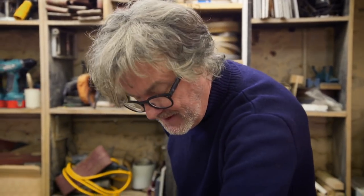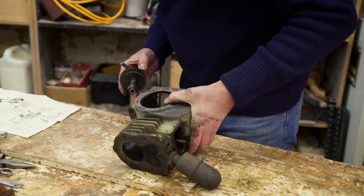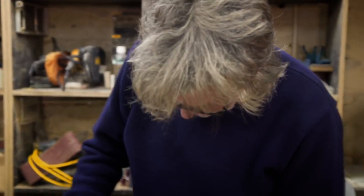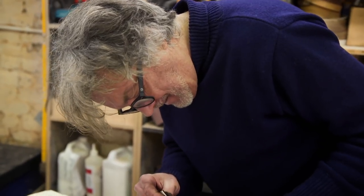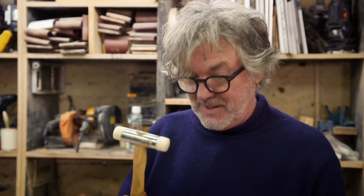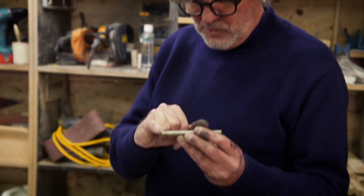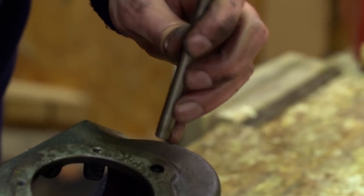This is the camshaft, and this is the camshaft spindle. It is very, very important to note — I'm going to check that this fits first. There's no reason why it shouldn't, but it doesn't. Or does it? Now this is risky, because if you tap something in, even with a very, very benign hammer like this nylon-headed one, that's all very well. But you can't then easily tap it back out. And there's also a danger that as this goes through, it will create a small burr or a scratch that will then stop it passing cleanly through the middle of the camshaft.